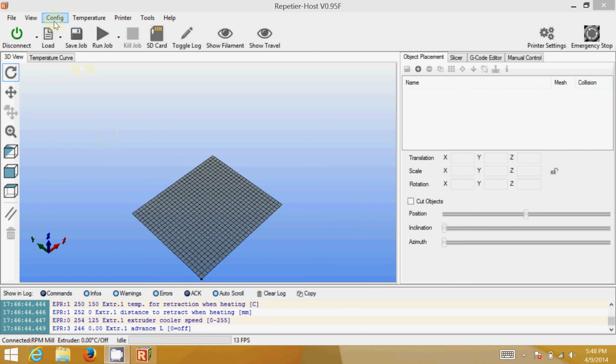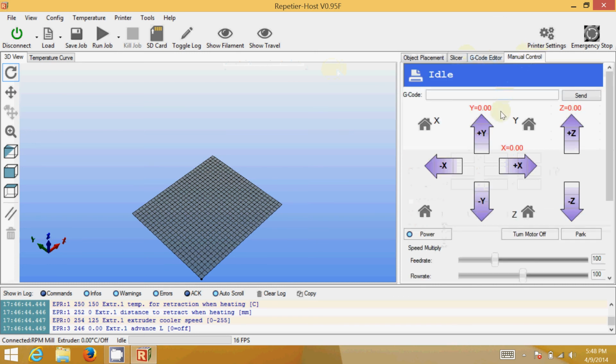And now you've changed the acceleration so that you can do CNC milling. Basically, you're reducing the acceleration because there's a lot more mass when you have the spindle on here. The next thing you want to do is once again make sure that things can move. The origin 0,0,0 on the RPM is the front left corner. If the back panel is facing away from you, that's the panel that has the power supply on it. The origin is the left corner that's closest to you. So the front left corner and all the way down to the bottom is 0, but 0 has a slightly different meaning when you're talking CNC milling.